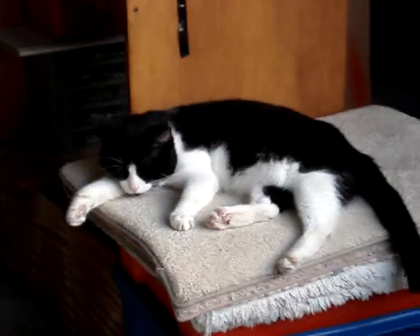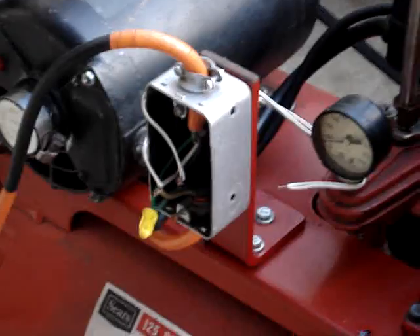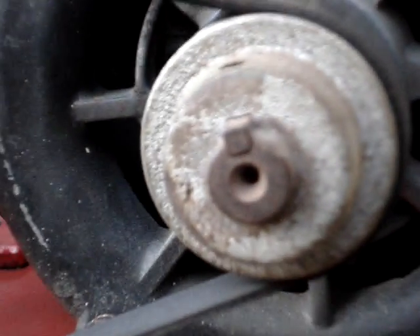Things have crapped out with my old air compressor — let me show it to you. It's a four horsepower old Sears model, cast iron double cylinder. They call it a four horse but it's only got a five-eighths inch shaft and it's a 15-amp motor. It's got one of these super multi-groove pulleys on it. It's a two-banger, 20-gallon tank. I bought it brand new — the thing's only 35 years old — and now the motor won't run.